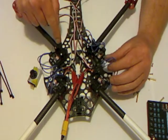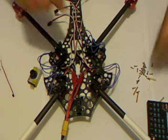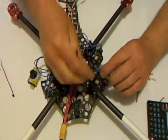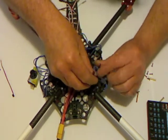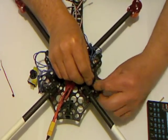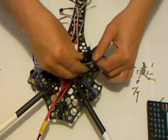I've got all my ESCs programmed up correctly and done all my motor directions as per the instructions. Now what I'm going to do is tidy up some of this wiring. Just like I did the little Z-bend inside the boom, I'm going to do the same here with the motor wiring, but instead of heat shrink tube, I'm using just one of the zip tie cable ties to snug that up. That one's done.